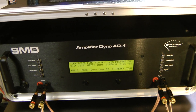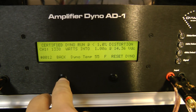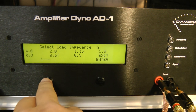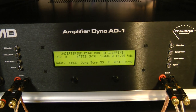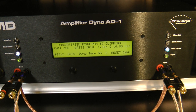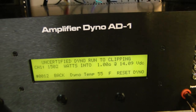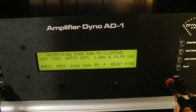Just for kicks, because you guys would probably want to see it anyway, let's see what it does at clipping — see if it hits that 1600 watts at clipping at 1 ohm, running track 4. The result: 1500 watts at 14.09 volts — uncertified, so that's at clipping.